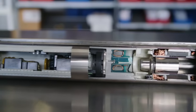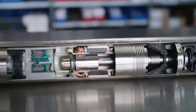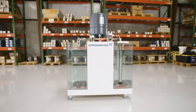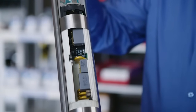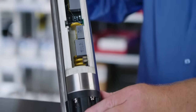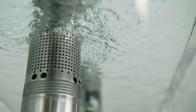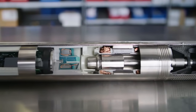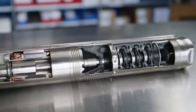The unique characteristics of the SQ electronically controlled permanent magnet motor allow for the use of smaller gauge wire when setting SQ pumps. The soft start feature allows the SQ to be installed with a smaller than normal bladder or diaphragm tank. Both of these can directly reduce the cost of installation. In addition, the micro frequency converter and the built-in motor protection eliminates the need for a control box or external motor protection device, making for a quick, simple, and economical installation.